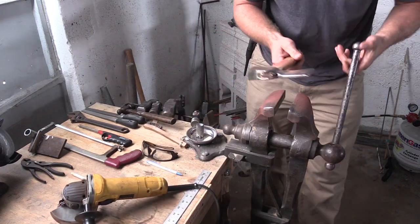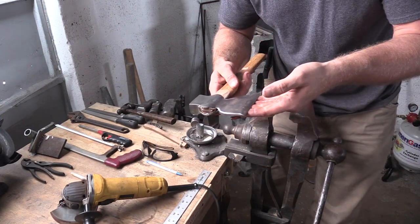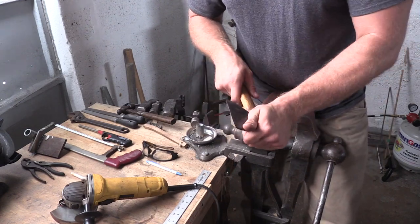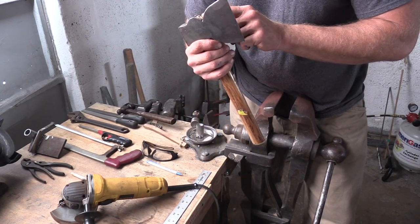No markings that I could see now on this. People might say about heating this up because I'm grinding it that long — listen, it's not going to change the temper. It's not even near lukewarm water, so we're fine.